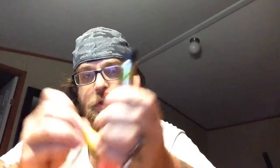That's all I got for you. It's a nice box. It's cheap. It's under 20 bucks. It's 19 and change. If you're looking to get into a dual, unregulated, parallel box mod, that's a pretty specific niche, I guess. If you're looking to get into any box mod, unregulated rather, and you don't want to spend a lot, I suggest this one. And because they're run in parallel, you can run it with one battery, if you so choose to. One battery, it's still firing. You just can't build as low.